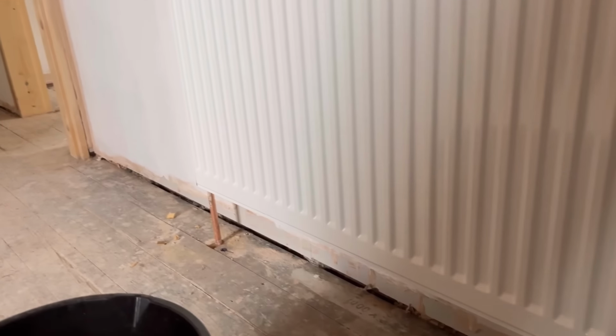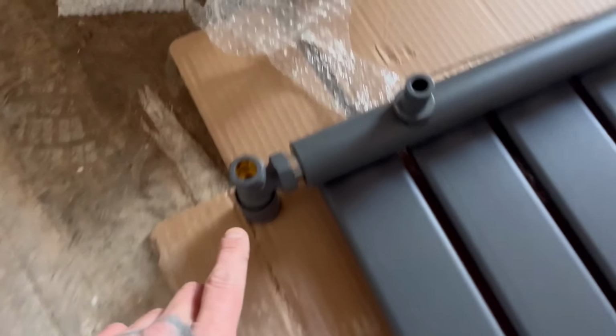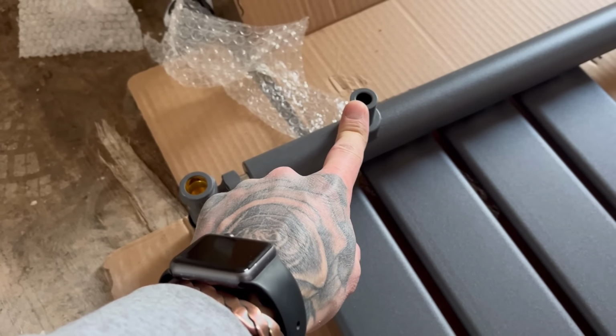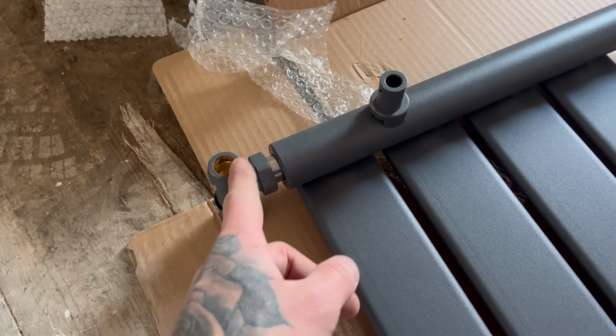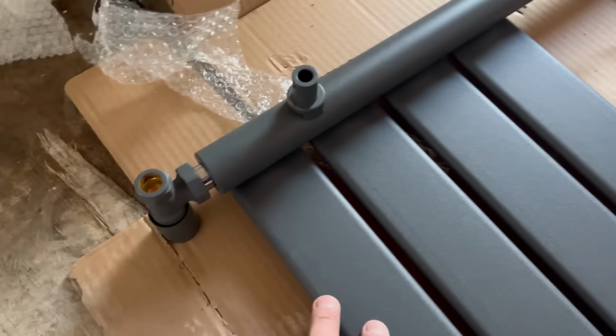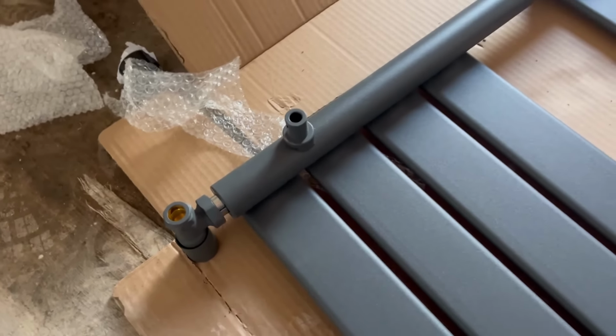Perfect, now I'm going to carry on doing that for that one, the other bedroom and the loft. So you don't need to see me do that on every single pipe. That would be incredibly boring. So we were measuring the brackets of this, you just measure from centre of pipe going out the wall to centre of bracket, and then mark them fixing points on the wall. That will give us our bracket locations.